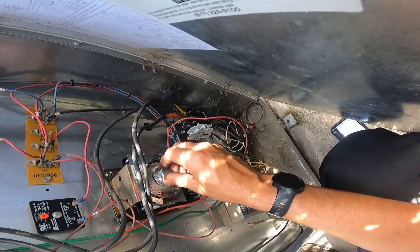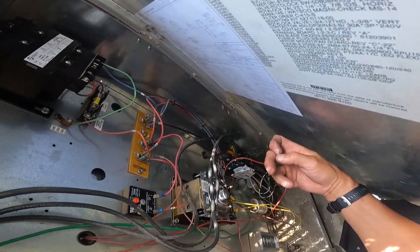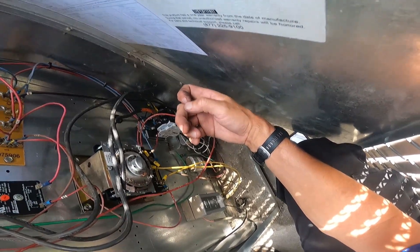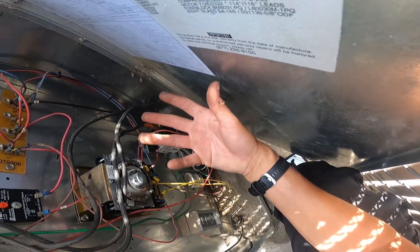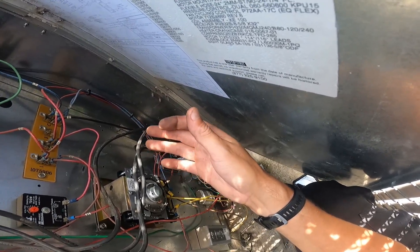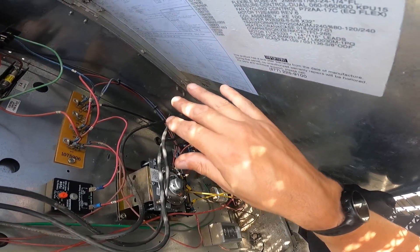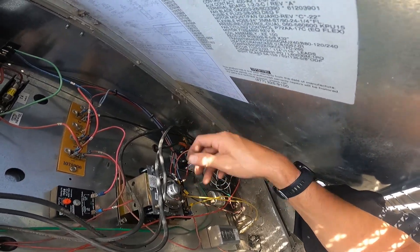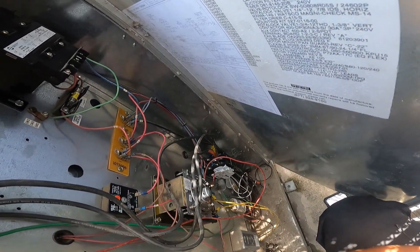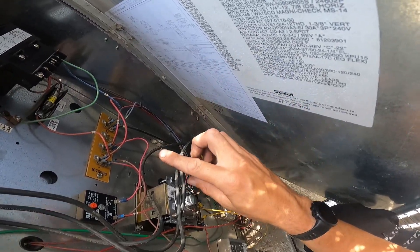Set this to the right time, hit the power, and walk away. The spike was up to 49 degrees and they need to keep it at 46. I turned the thermostats down by one degree. This condenser by itself isn't going to keep reaching that temperature forever — say this thing got stuck for three or four hours, the temperature climbs, and maybe the motors pop themselves out and go back to normal mode. One condenser running alone had a bad compressor, so they were maintaining 48 to 52 degrees off just the one unit doing everything it could.